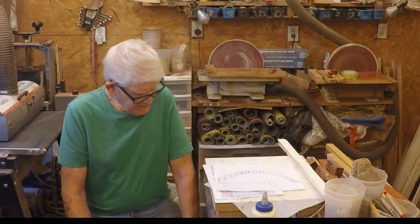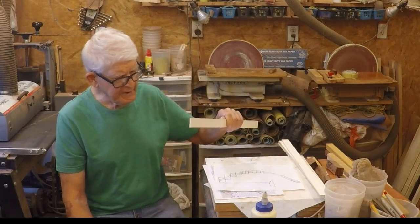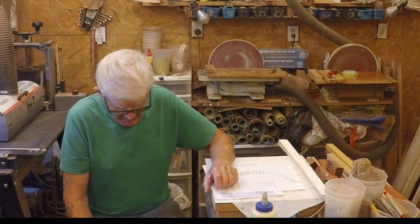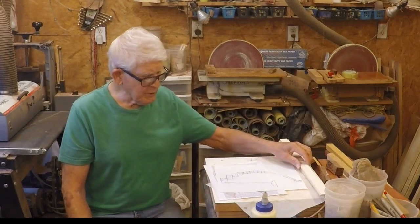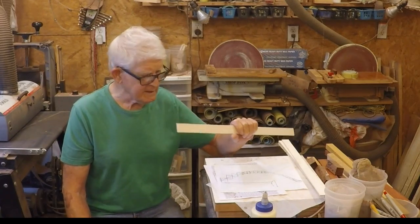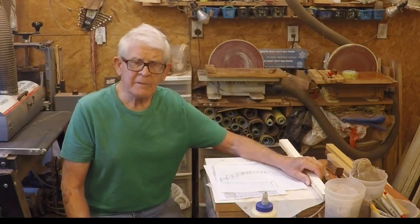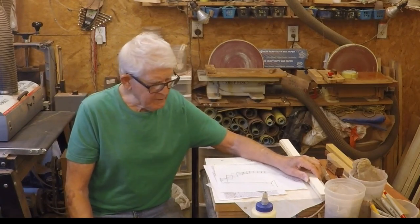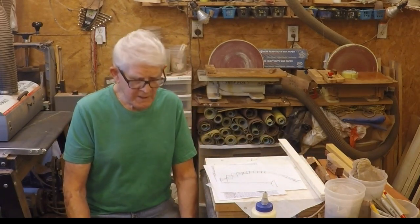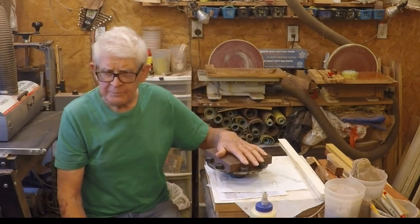The pattern ring I'm going to build the same way, using spacers of holly between the segments, so the actual pattern ring will just be spacers — I'll show you how when I get to it. The first thing I'm going to do is make the base, then use a thin ring. Normally I'd make a thick ring, put it on and part it, but I haven't got enough holly for that. So I'm going to cut segments and glue them on one at a time, just like open segments, only they'll be closed segments. I'll prepare the base and put it on the chuck.